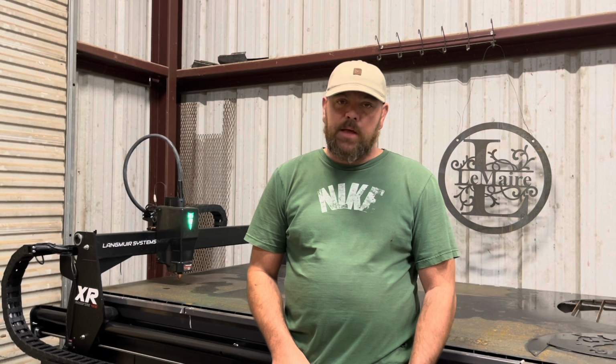So anyways, I was probably ready 3 or 4 days ago, and I've been spending the last 3 to 4 days just learning about SheetCAM and Fire Control and trying to get my design process down. Like I've said, I've used CNC before, so I'm using LightBurn, V-Carve, and Inkscape to draw my vectors. And I'm really having a lot of luck with LightBurn as far as having it not put extra stuff into the vector. Exporting it to SheetCAM, doing my tool pass.